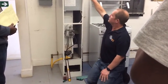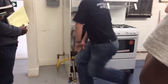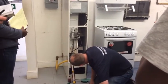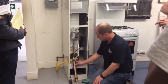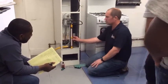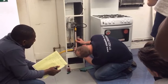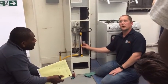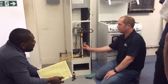The pilot's on, so we can pop the warm air unit on — if we turn the plug on. The burner's away now, the burner's burning. Reading the gauge nice and accurately, I'm going to get my eyes down level and make sure it's reading the same both sides of the gauge. I reckon we've got 12.5 millibars. I'm happy with that reading.